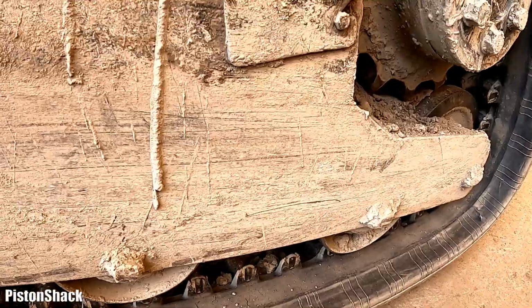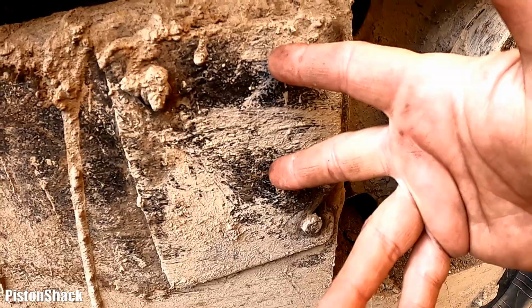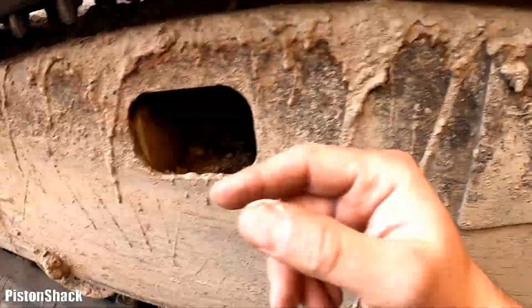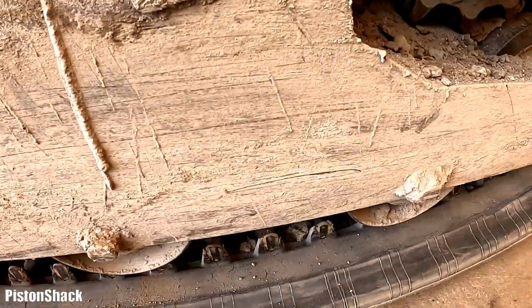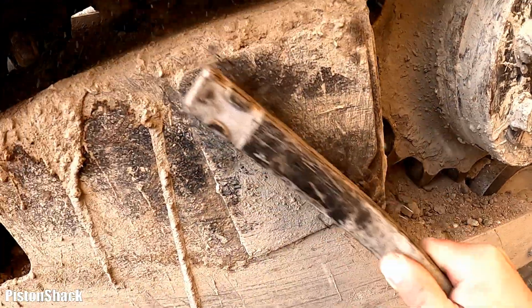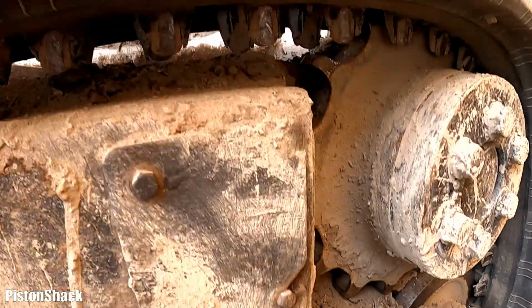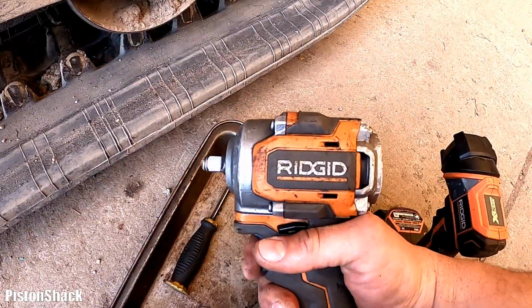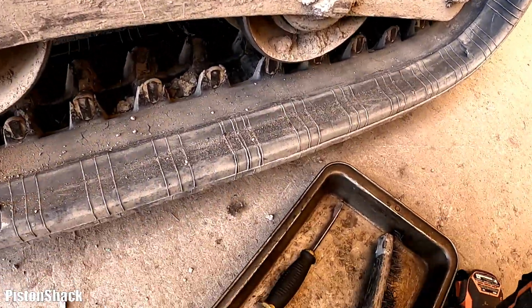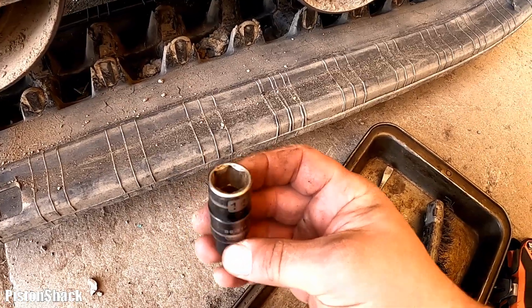Safety goggles. All right, here's our door panel covering the access to those two grease nipples. When you pump the grease in, you get the tension up, or release the nipple and get the grease out and release the tension. Yeah, let's clean those bolts. Lots of clean dirt around. I tried to clean as much as I could with a little speed shovel, but a little bit is here. Let's undo those bolts. Trusty Ridgid, and we're using a 14 mil socket.